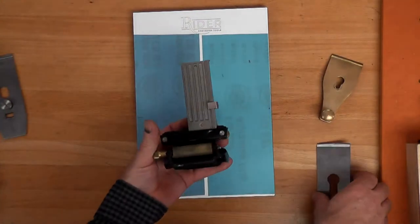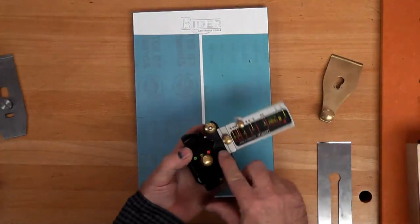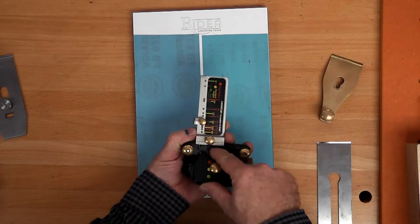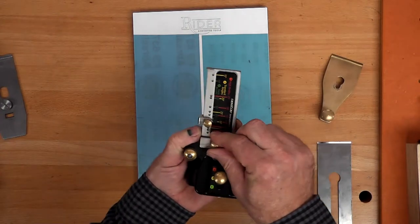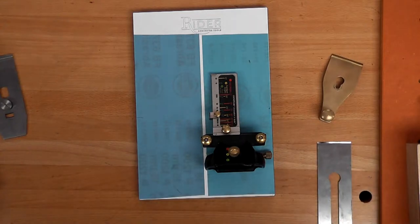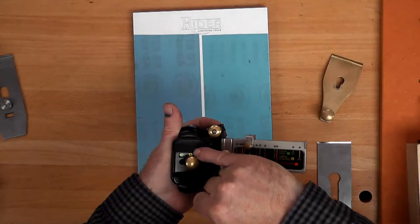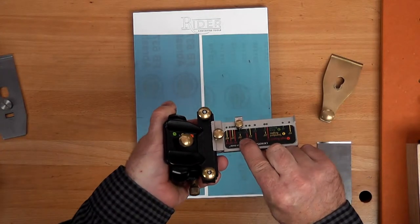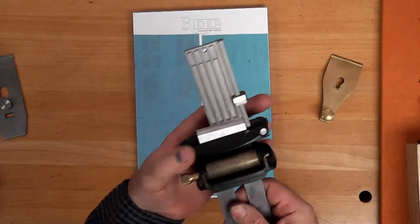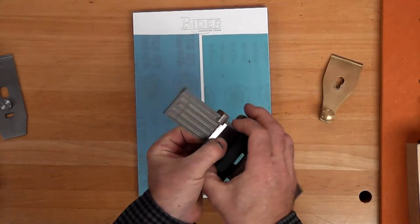Honing guide. Going to go with Veritas one. I have got just over 2 inch wide as a blade. So there's a scale on the front here where I'm looking. That says 2. I want a 30-degree sharpened edge, so I've got to put my glasses on now. Check on everything's right. Yellow dot in the middle, 30 on the scale on here. Going to turn it over. Slide my hand through.